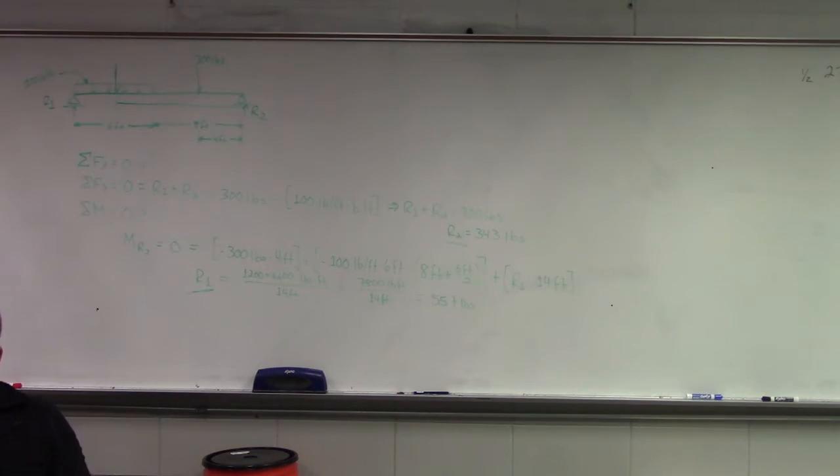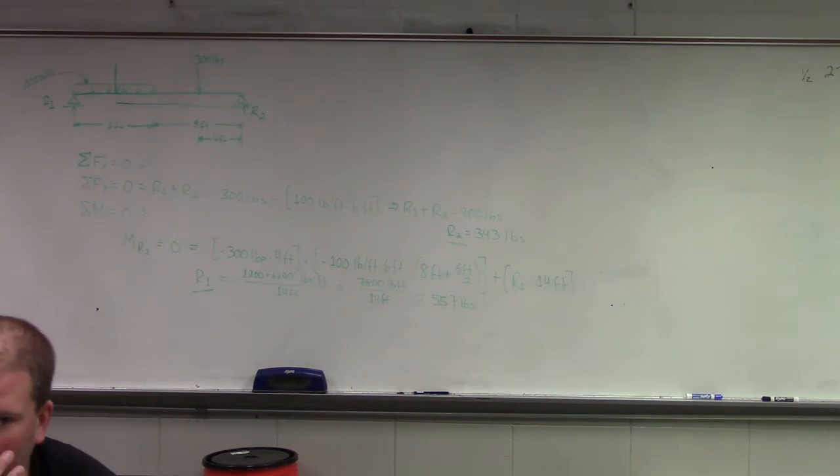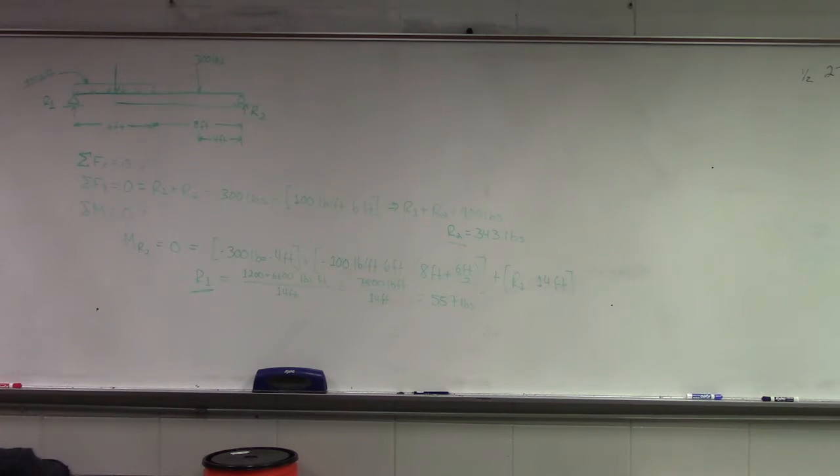We'll talk about this stuff more after spring break. Your floor joists will be running this way. If there's an 8-foot corridor right down the middle, your span is 21 feet, so you go back to this chart. For a span of 21 feet or more, you need 2x12s. So is that what it's asking us for, the design of the roof joists and beams, exterior walls, columns?